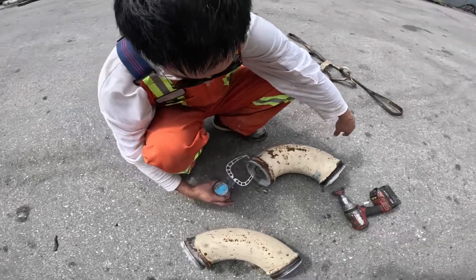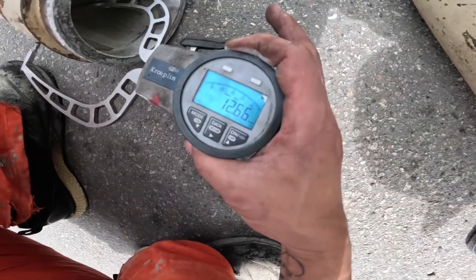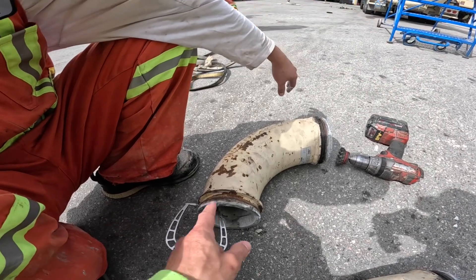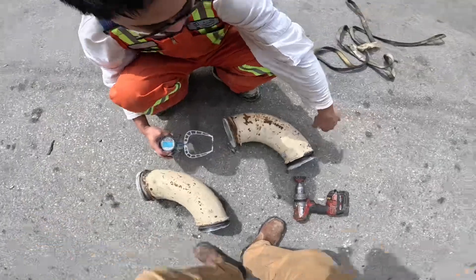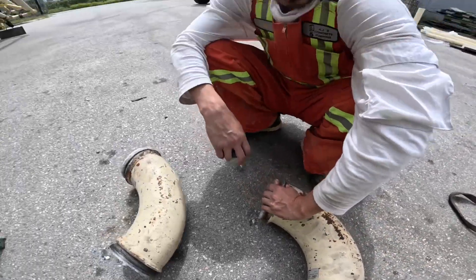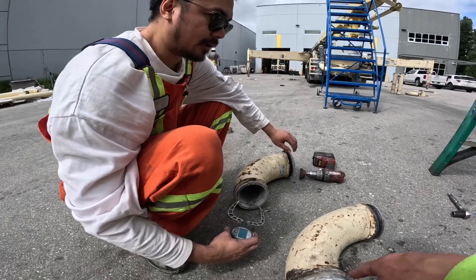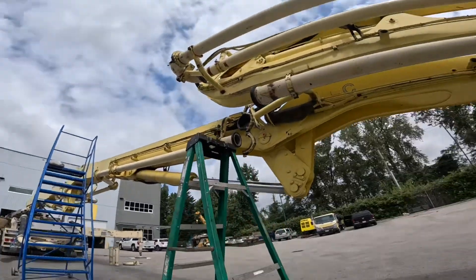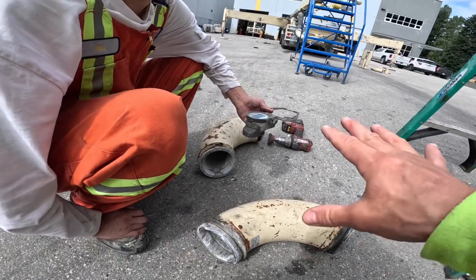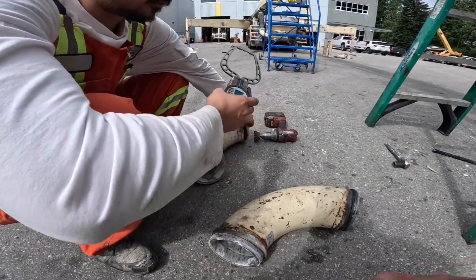What's the measure? About 480. Go inside the tube. Because we're doing the whole boom kit, just swap them out. All these elbows marked 265M — those are actually CCI elbows, super heavy duty — so keep them in a pile. When we re-pipe one of the smaller pumps like the 24-meter, we'll use these; they probably still have 50,000 meters left in them. The ones that say Esser 900 are just hardened steel elbows — those won't be kept. Only the ones marked 265M.